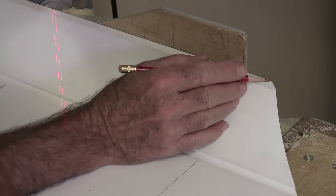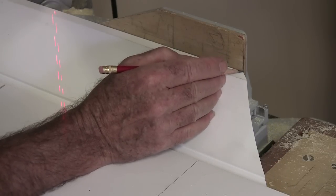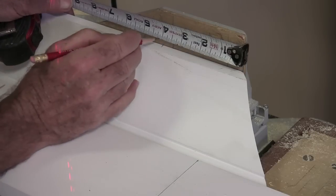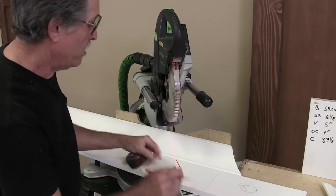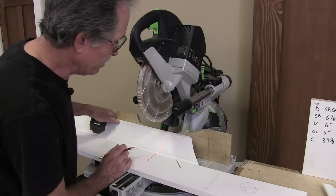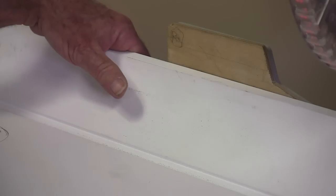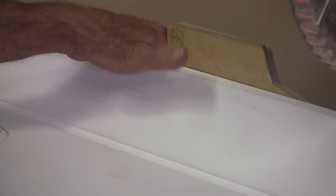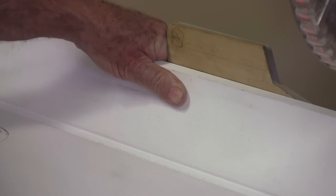This piece has an outside corner, so I want to take that short point and flush it up with the edge of my miter saw fence, then hook my tape there and make the measurement mark — four inches to a butt cut. I want a nice crisp, thin, precise line. Now I'm going to take this piece, swing the saw to 90 degrees to make that butt cut, and bring that laser line right onto the pencil line. I take my left hand and butt it up tight against that fence with my knuckle right against the fence so it will not move, then wrap my thumb over the molding and use my thumb as a fine adjustment tool to incrementally move that measurement mark right up to the blade. That's how I cut precisely.